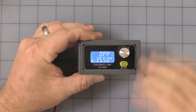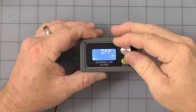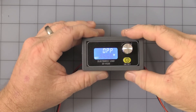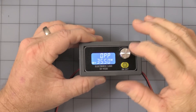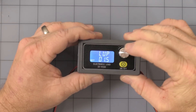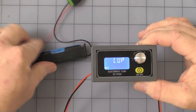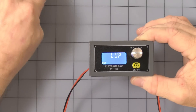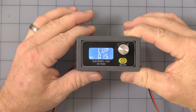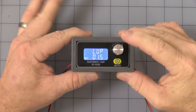One more click press and you're into over-power protection — basically the wattage. You can dial in whatever wattage setting you want. It's factory set at 35.5 watts. Same thing — you would have to press and hold to activate it while it's flashing; while flashing it's just in programming. One more quick press gets you into low-voltage protection. This is very important when using rechargeable batteries — a lot of these batteries you don't want to get below a certain voltage or you will damage the battery. So it's very important to look up what the low-voltage protection setting should be for your type of battery.